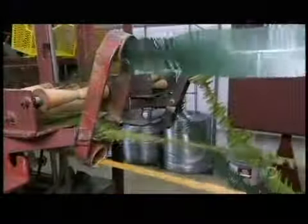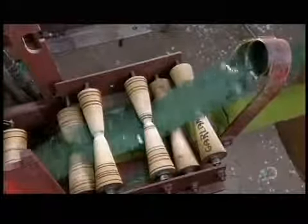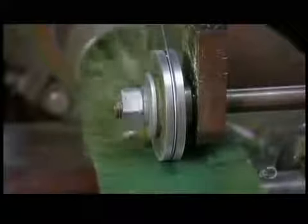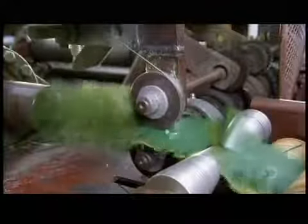These artificial needles come in an assortment of colors, so if you want glitz, you can really go out on a limb. Here, streams of the fringed green and a strip of brown PVC travel over tension control guides. Steel wire unwinds and merges with the green and brown PVC. This machine twists them together. The brown strip lands at the core of the twisted fringe, creating the illusion of a stem among the needles.